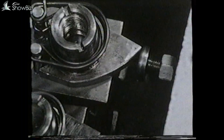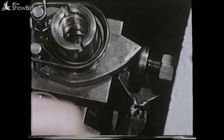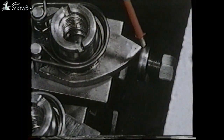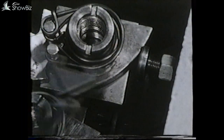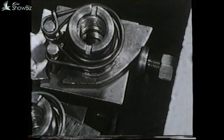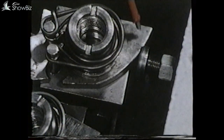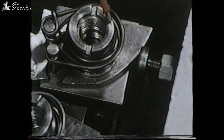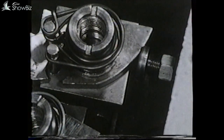This measurement is correct. Here is an example of over-adjustment of the brake band — the cause is that the striker screw has been set out too far. Here the problem is one of under-adjustment, and there will be a number of causes for this condition. It could be that the striker screw has been set too far in, the striker plate may be binding on the adjuster nut, the adjuster nut may be tight on the pull rod thread, or the adjusting spring may have been incorrectly fitted or broken.